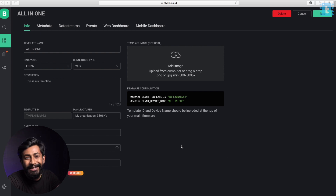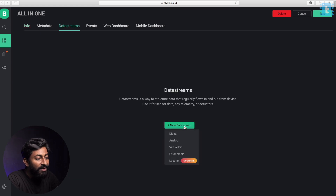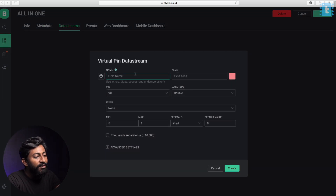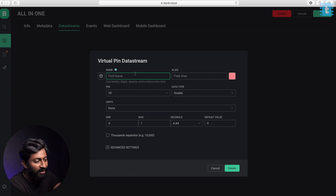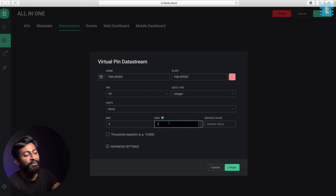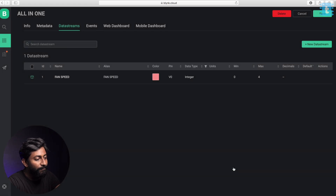After that, you need to add the data streams. Those who have used the new Blynk platform must already know that 'data stream' is a new term added to the new Blynk platform — it's the same as adding variables to our Blynk dashboard. Go to the data stream section and click on new data stream. They also added a digital option this time, but we don't need it — we will still be using the virtual pin. Click on virtual pin and give the field a name. We will have a total of five different virtual pins: four for AC appliances and one for fan speed control. Let's start with fan speed — I'll name this field 'fan speed', virtual pin will be V0, data type will be integer, and the range will be from 0 up to speed 4. Click on create.